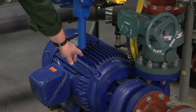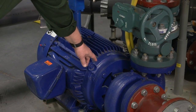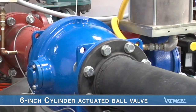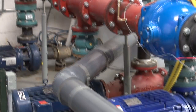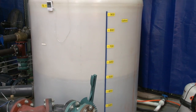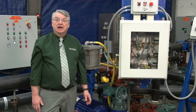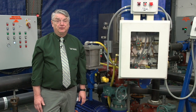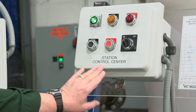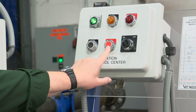Today we have configured the flow loop to pump water from a 40 horsepower centrifugal pump through a six inch cylinder actuated ball valve, through a long line of piping and back to a 1,000 gallon water supply tank. The pump is started and stopped using a conventional full voltage motor starter connected to a remote control panel with start and stop push buttons.